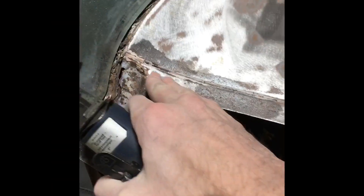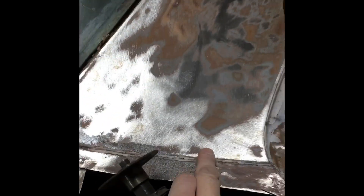Cut away the majority of the remaining part right up against the flanges where they meet, because this one right here is going to line up meeting here on this deck filler panel. I'm just going to get them separated and break those free once I get the majority of the metal out of the way. Ultimately, I'm going to have to pull out the back glass, because this flange here where the glass sits has got to get exposed to remove that part and get that tucked under the glass.